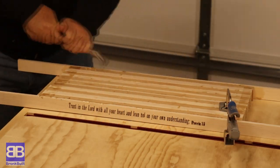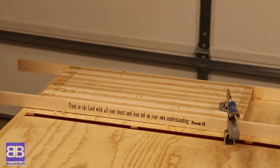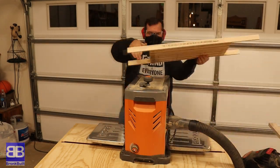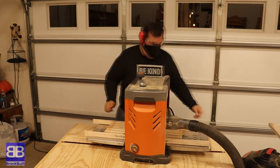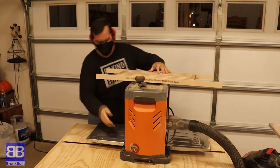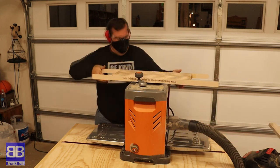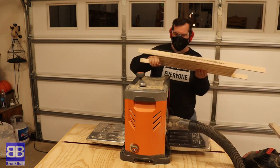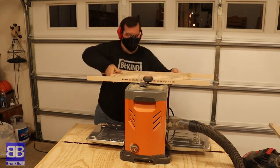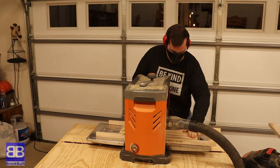Now that everything is glued up, I can take my paint scraper and scrape off the dried glue from the top and the bottom of the board, and then send it through my planer to smooth out both sides of the board and to get it to its final thickness. Notice that the final two pieces are cut extra long. This is so that any snipe that occurs going through my planer will happen on the waste pieces. This allows me to maximize the length of the board as I know I'm going to have snipe because I know I do not have my planer dialed in perfectly. For those of you that follow my channel, know that this was actually made before I swapped out my cutter head from straight blades to helical cutters.